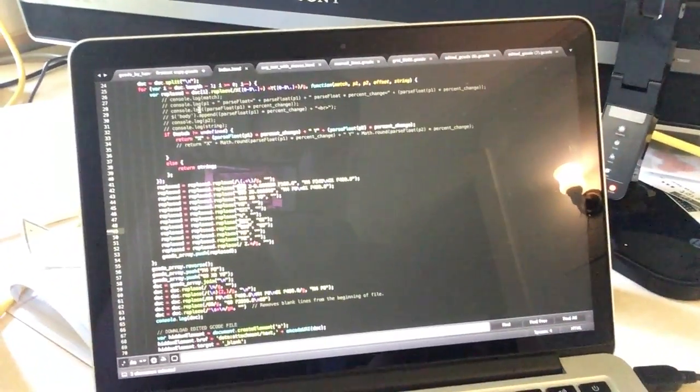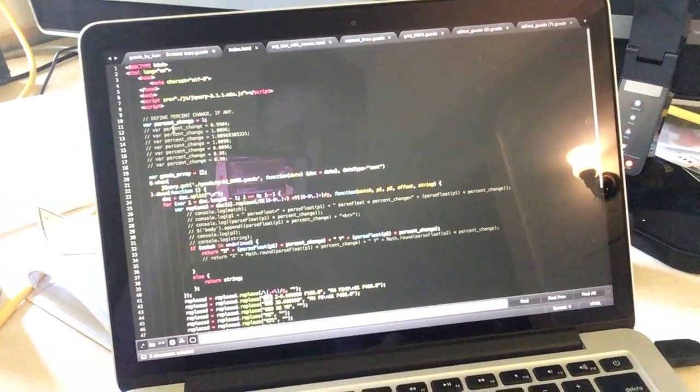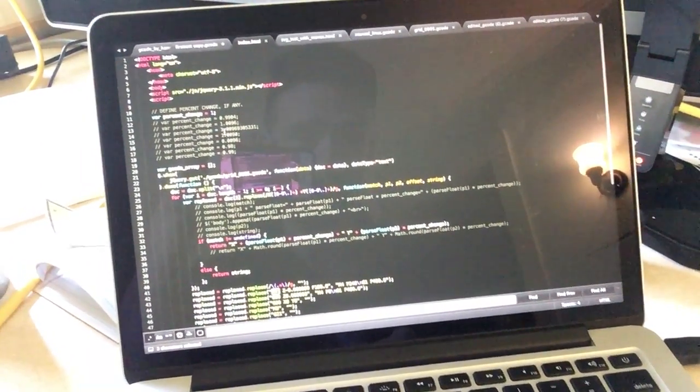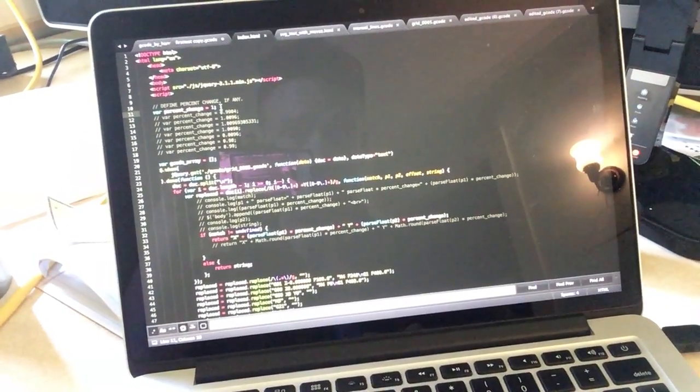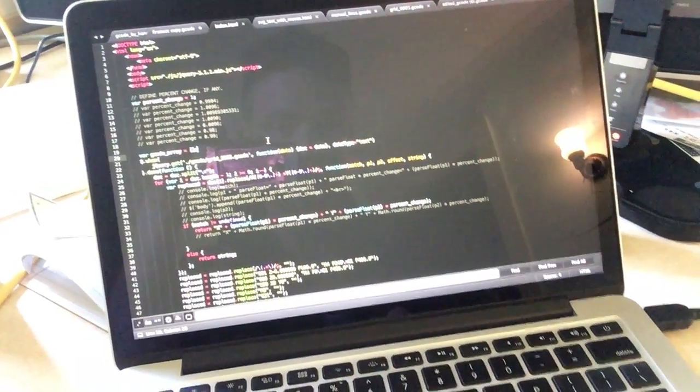All of these tests have led me to believe this is maybe a scaling problem. In that same code, I wrote something where I can actually adjust the scale of each G-code coordinate. You can see I've tried a bunch of different numbers here, all commented out now — right now it's back on normal scale. The reason I thought this was a scaling problem is within M-Laser's own test pattern — the little M with the ruler on it — the scaling of that is not correct.